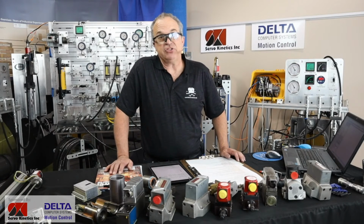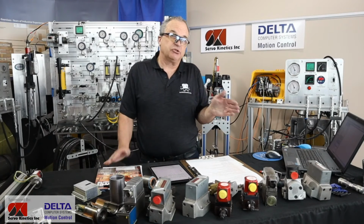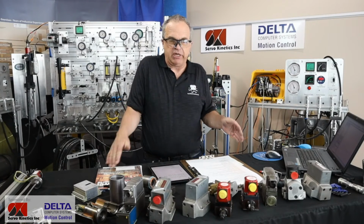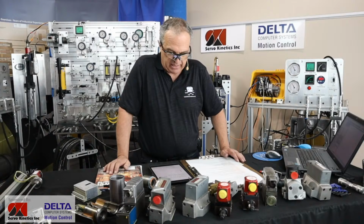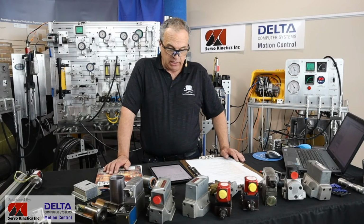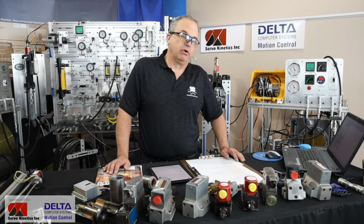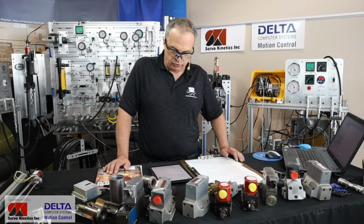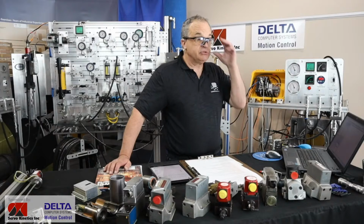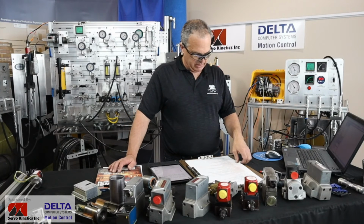That's a very sensitive spring, and I think in order to get the response you need from that single spring, which does a great job of giving you the same kind of response on each side, you'd probably want to go with a factory or original. The force behind that spring will be quite important. Yeah, you'll want to get the original spring for a sensitive valve like that Rexroth 4WRZ. But great question.